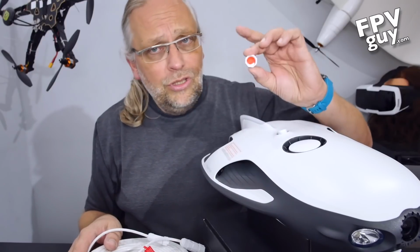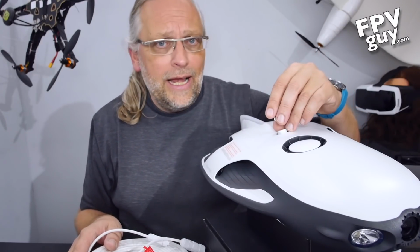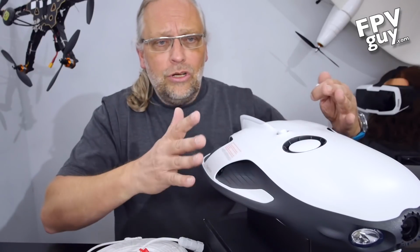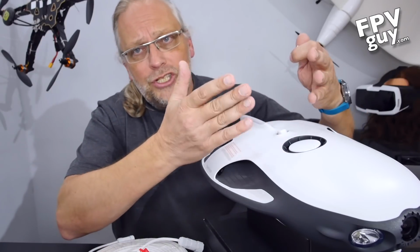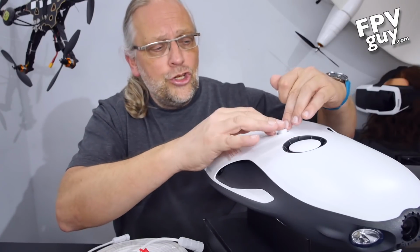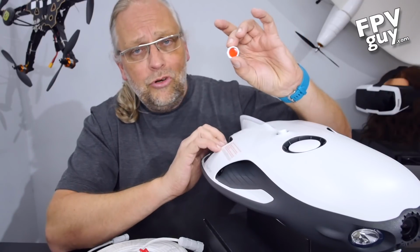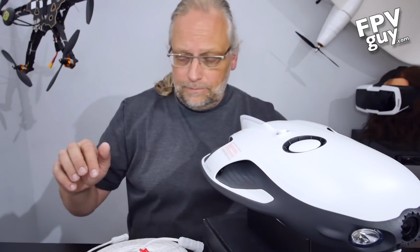But when you put the cap back on, make sure you have completely dried this. So once you're done sailing, you may want to have this up in the sun. Let the sun dry it. Use a bit of a towel to make sure there's no water around this plug. So it's completely dry before you put this on.